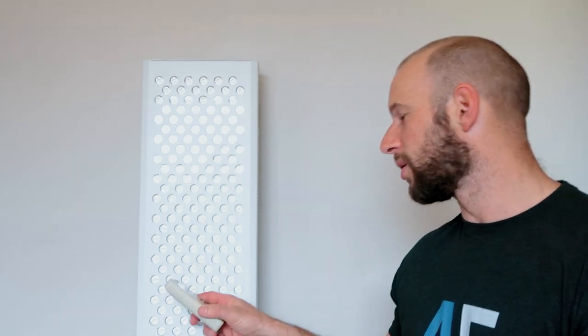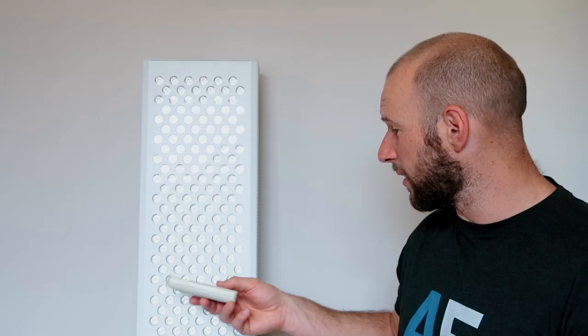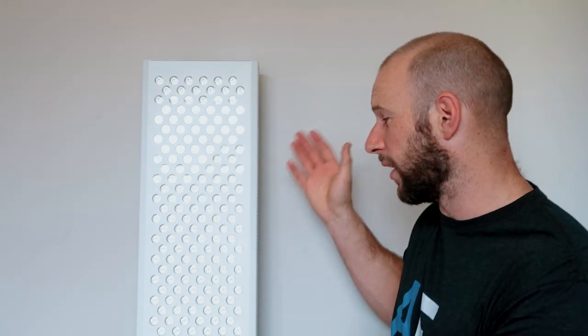The main ones we're looking at are magnetic and electric. Electric, unless there's really bad wiring, isn't usually an issue, but the magnetic one can sometimes be a problem. However, with these newer generation panels I rarely see readings above the green zone. When I turn the meter on, you can see an orange light blinking — it goes from green through orange to red, programmed to building biology healthy home standards. Green is safe, orange is risky, red is potentially dangerous. I turn the panel off, then on, to see if there's a spike, let it stabilize, and hold that reading for a few seconds before sharing the data.